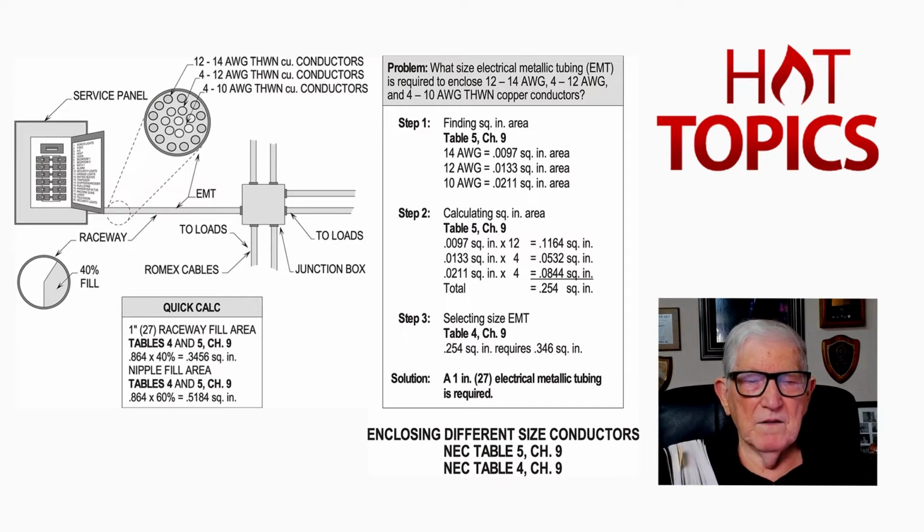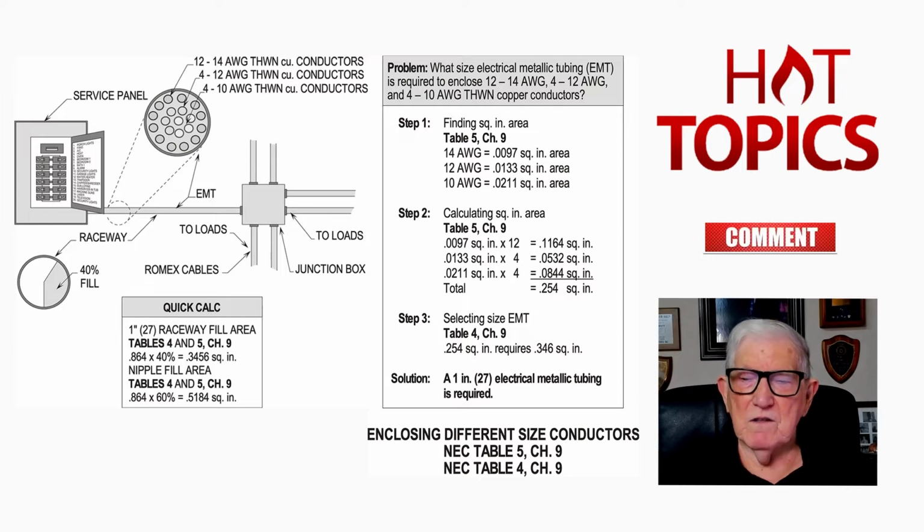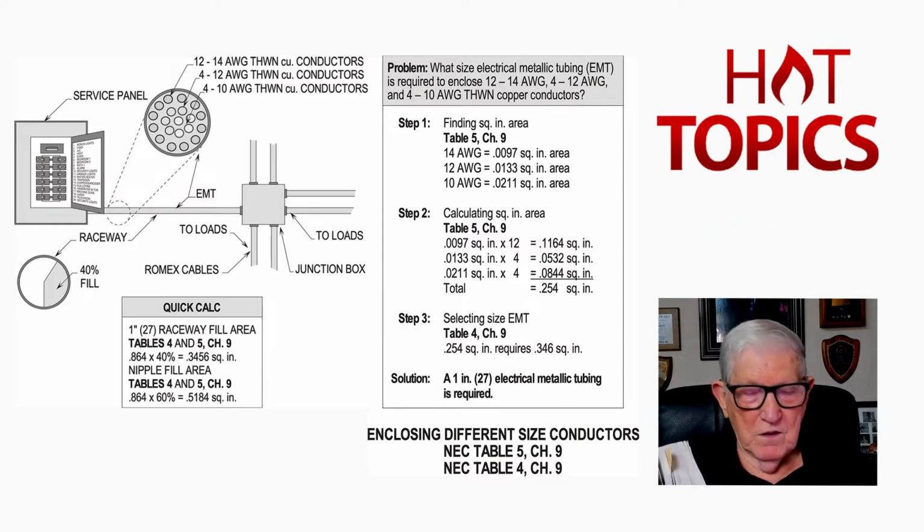Now, that's given to you in item number 3 here on page 160, right-hand side of the page, section number 310.16.3. Now, this is new. This information was taken, revised from our table 310.16. It's not in that table anymore. They moved it here to give you this information for all the tables, 310.16 through 310.21 that we might want to use. And see in item 3, wiring is installed in a 30 degrees C or 86 degrees Fahrenheit ambient temperature.